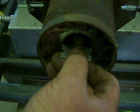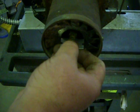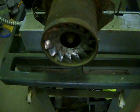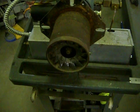The nozzle should stick through 0 to 1/16 of an inch. It should stick through the retention head there. You put a razor blade across the end there. It needs to be through a little bit. That's very critical in the way the flame runs.